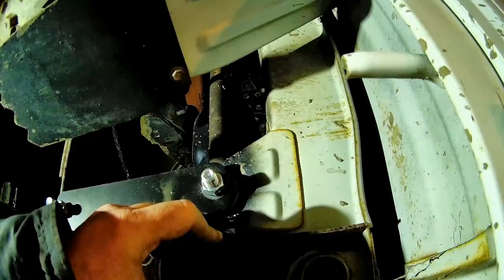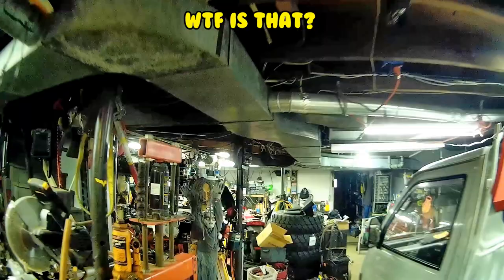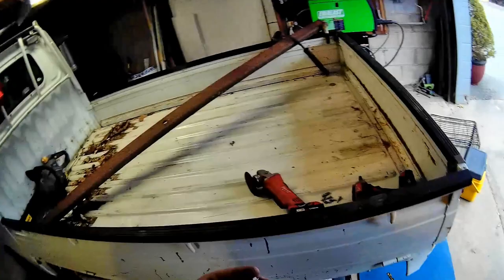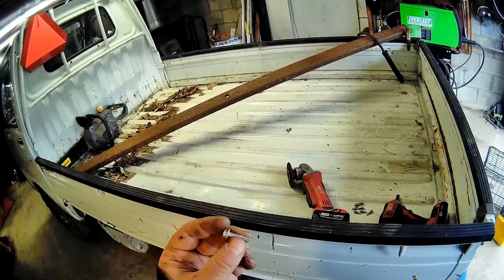They're definitely going to have to go right at the bottom. Same thing over there. What's that sound? Do you hear it? It's a funny squeaky sound. Guess I smoked up the house a bit much - you couldn't hear a dump truck driving through a nitroglycerin plant. I'm going to use some fine thread drilling and tapping - that's how I'm going to hold it up in there until I get done marking everything for welding. Then when everything's all up in there, I can take these out and just drill through and put bolts.